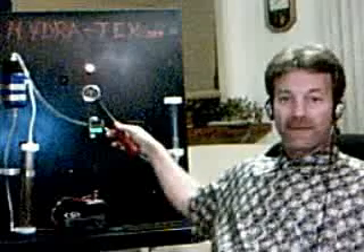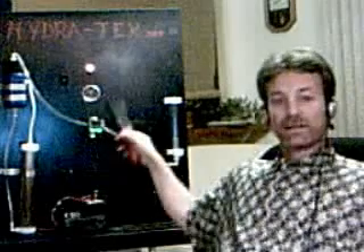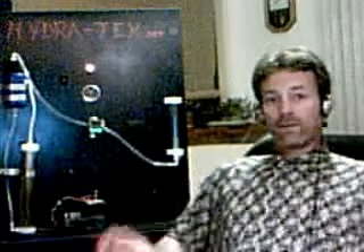We make this an efficient cell that will continue to produce the same amount and the same quality of gas all the time. When you find the right mix for your car — which may be between a half and one liter per minute of gas — you want to maintain that. Start off at five amps and slowly work your way up while you do mileage tests. Note when your mileage starts to drop off; at that point you have reached what I call the threshold effect. When you put more gas in, it'll slow the piston down and give you worse mileage. So note the amp draw when you reach that threshold effect and maintain that amp draw, which maintains your mileage increase.